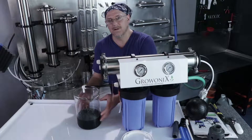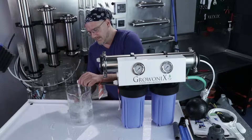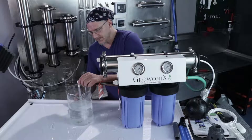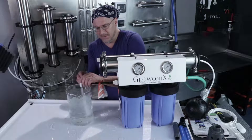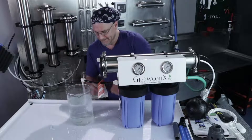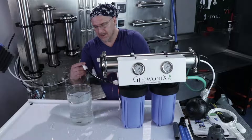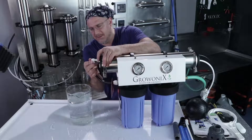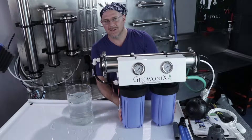We're going to run it for about 20 gallons until the water turns crystal clear. After flushing for about 20 to 30 gallons, you can see the air pockets are out of the feed water stream and the water is crystal clear. The pre-filters are now ready to be routed to the membrane — just plug in the stem elbow on top, make sure it's seated all the way, and the carbon filter has been flushed.